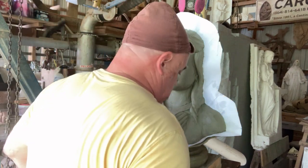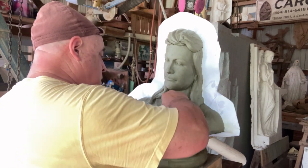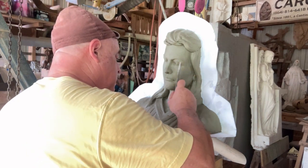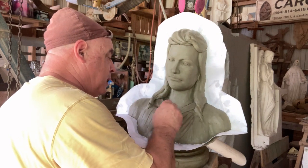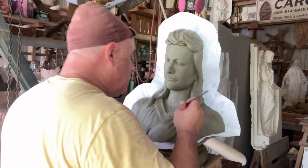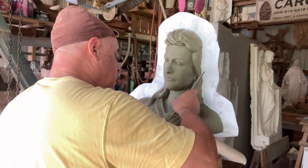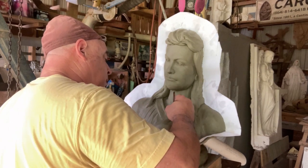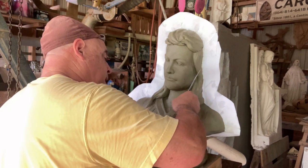I've tried to go through and make sure, right there, that I don't have any big keys. What will happen when you put your silicone on, and I mentioned this videos ago when I was casting other models way back in the beginning, for people that were paying attention: if you have voids underneath something and you try to work the silicone in, buddy, it'll find them. And when you take it apart, it'll lock and pull apart and damage stuff.